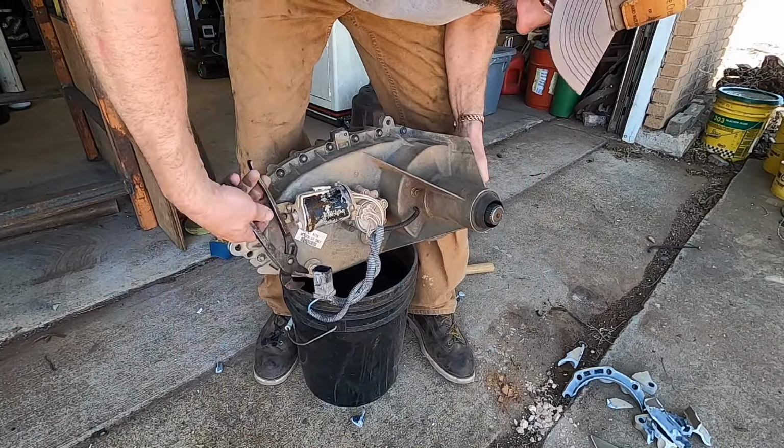Look at that. It appears we forge welded a piece of grit into the steel. Okay, there's a quick etch on this. It's really not that impressive, but the reason is, I believe, because you can't distinguish between what is actually a bunch of different layers. I mean, all these pieces in there are separate, and I think what you're seeing here, the darker color, I think that's the pins. And so adding powdered steel is definitely going to make a better pattern. So let's do that.